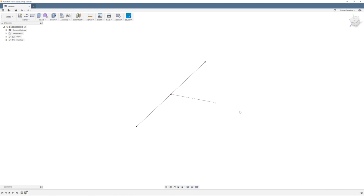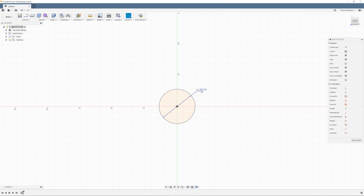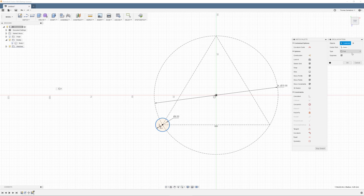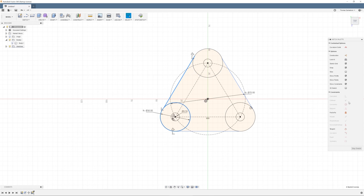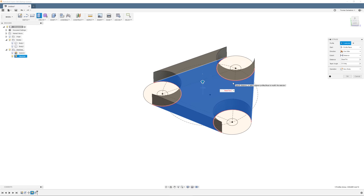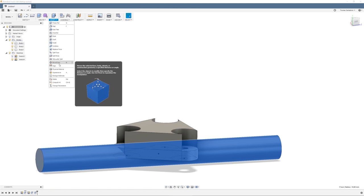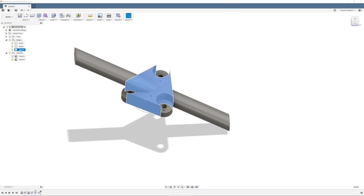There's one more 3D printed part in this project that I needed to design: the broomstick handle holder, which connects the handle to the actual business end of the tool. Because this needed to connect to two other parts — mainly the platform the hex grids sit on and the actual handle — the design approach was a bit different. I started out by sketching up the broom handle and working my way around it, entering dimensions directly at first to get a rough idea, then exchanging those for parameters so I can change them later.